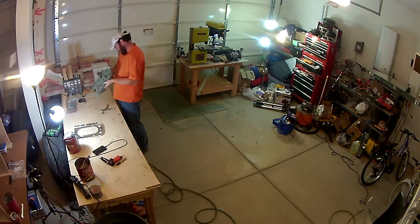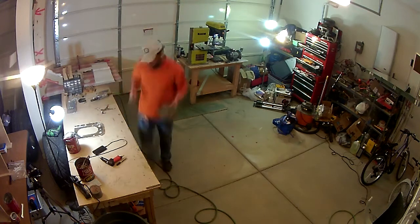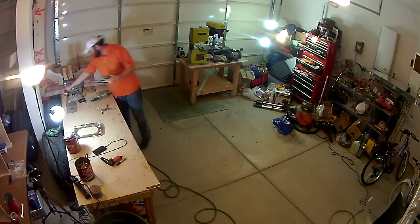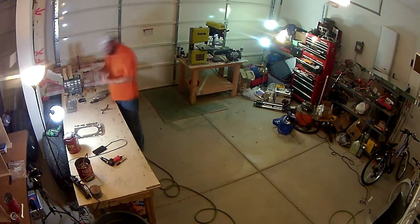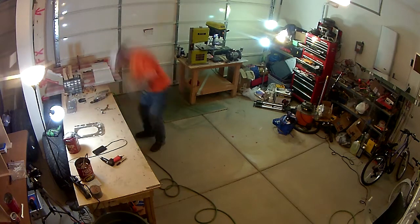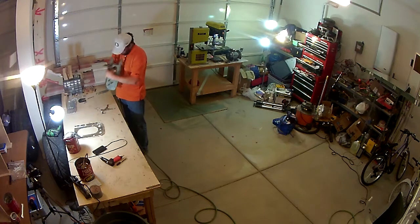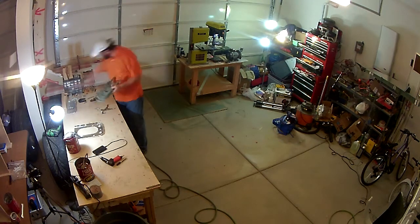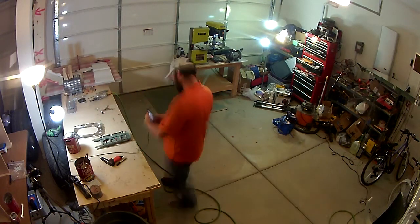One of the things that I need to get, and I had originally purchased one, but I had no idea how to use my pneumatic squeezer. Right now I'm using spacers to get the gap set correctly when I'm squeezing rivets. Well, there's a tool that you can attach that is basically a shaft that you can use a wrench and adjust that gap. Instead of using spacers, you just turn the shaft and it closes or opens up that gap so that you're setting the rivets correctly.